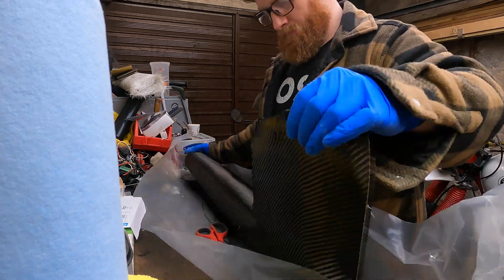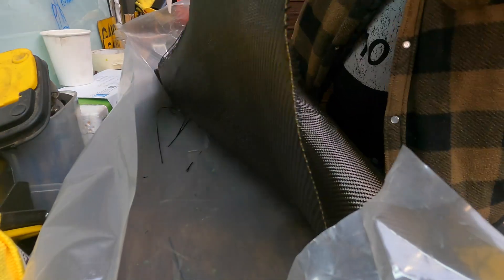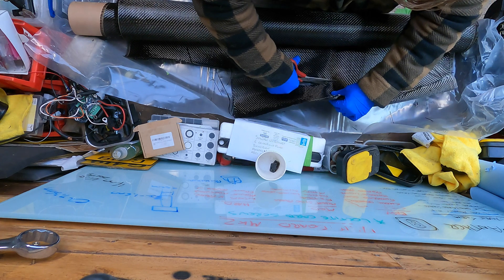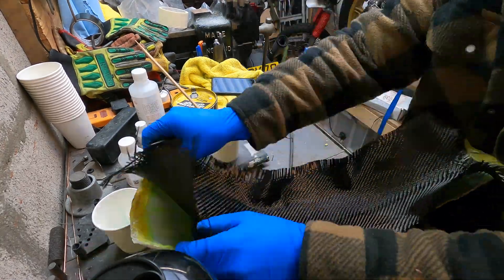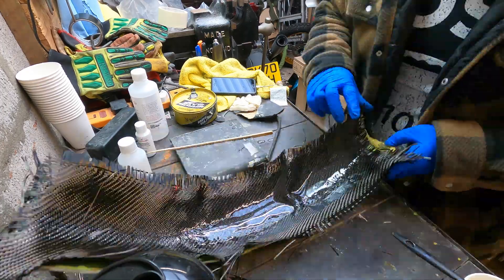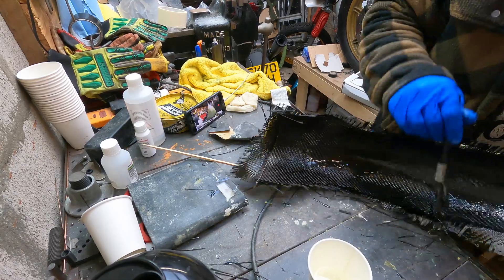Carbon fiber wise, I ordered a few rolls — initially bought a starter pack from Easy Composites. I'll put the link in the description. This first bit of carbon fiber that goes down is the one that gives you all the visual, so it's really high quality. I just had to make sure to cut it all to size — not to waste too much but also to have enough. I then weighed that and made up some resin; a ratio of one-to-one for weight to resin is a good rule of thumb, maybe a little bit over on the resin. Then just start layering it up — this is a wet layup — so make sure your fibers are aligned and take your time.